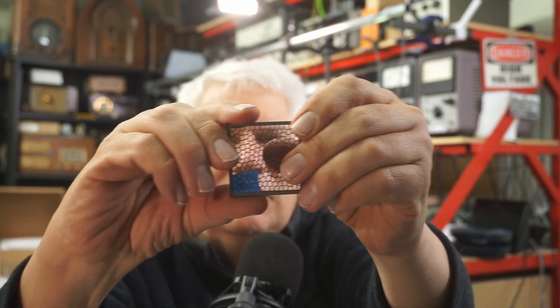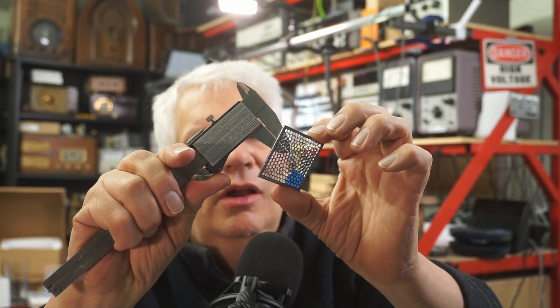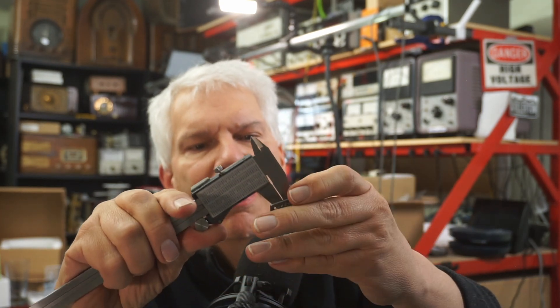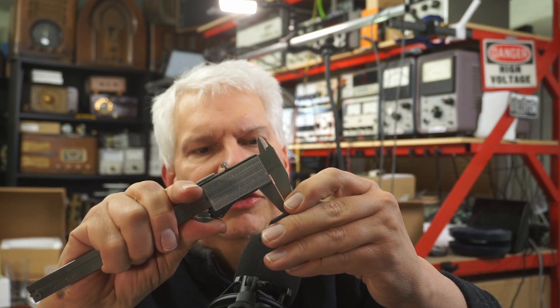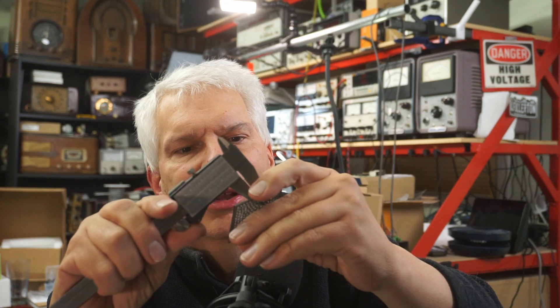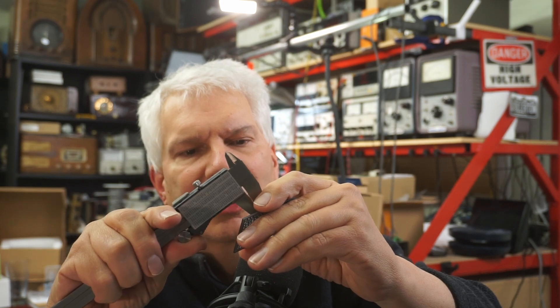They're not actually circles — they're some kind of shape pattern. The bridge width on these things is really small — half a millimeter. For those working in inches, that's about 18 thou for the bridge widths. Some are around 20 thou. There are 200 holes total. This one I slowed down even further to 40 inches per minute and turned the power down to 400 watts.